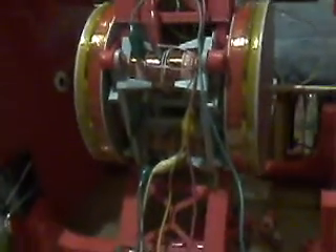I just thought I'd do a quick test on the rotary system using the solid-state driver circuit, because I was curious — since I put the new flux traps in. If you remember from previous videos, I use my flux trap with the steel laminations, and that is on each end of where the actuator coils are. I hadn't tested this with the flux traps on here, so I wanted to find out how much isolation it gives. It actually gives very good isolation.